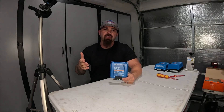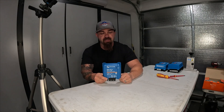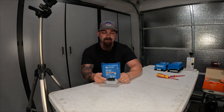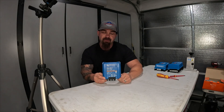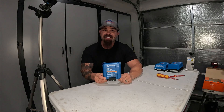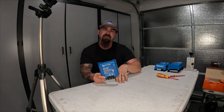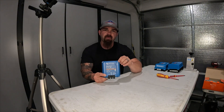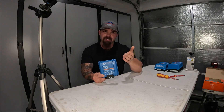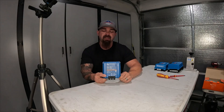Now we've taken a look at the device itself and talked about the differences between the 50 amp and 30 amp models. We looked at things that were concerning — like no heatsink fins — that could play a role in longevity later on. Victron makes a really quality product in pretty much everything they do, so I don't anticipate any issues. It just seems odd that they were so robust in the past, but now increased the amperage spec while the heat dissipation properties are decreasing. We'll give it a run and torture test these things over the next few months and see how they go.